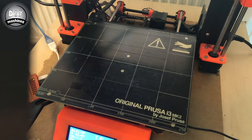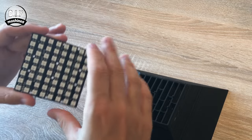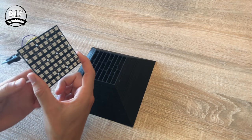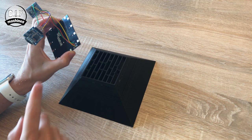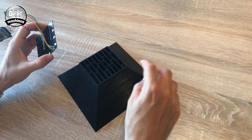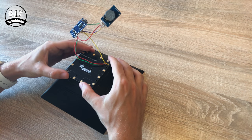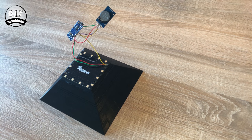There's not much left to do now. We'll take our electronic components and our first 3D printed part. We have 6 pins here which line up with the 6 pin holes in the Adafruit NeoMatrix. The orientation matters on this — you can tweak it later in code, but it's best to get it right the first time. The corner with the three wires soldered onto it wants to be attached in the location here — this is the corner with the smallest hole in it — so just slide it over and drop it down into place.